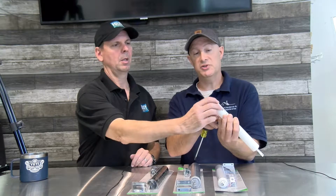These closers have just one adjustment on the front. It has a speed adjustment with directions for making it faster or slower. Sometimes you might change out from glass to screen — if you have glass in for fall and winter and then change to your screen, your storm door is going to move much faster because there's a lot more air passing through the screening. So you might need to adjust and slow the door down. All you need is a Phillips screwdriver. Right inside the piston there's a screw — that's basically just an adjustment screw in the piston itself, right on the end.